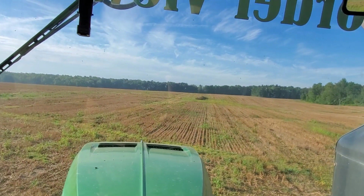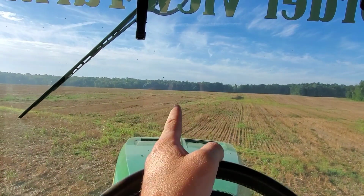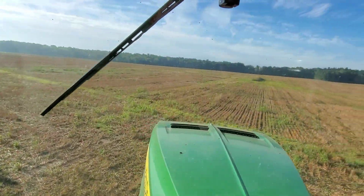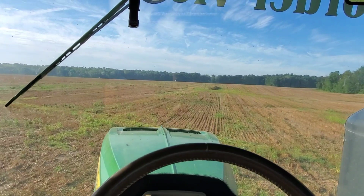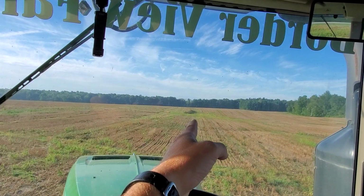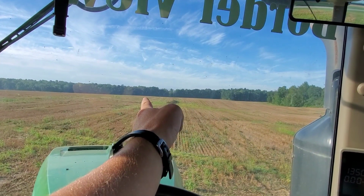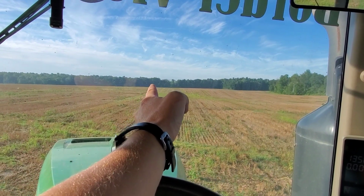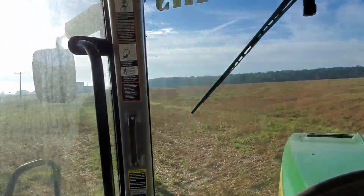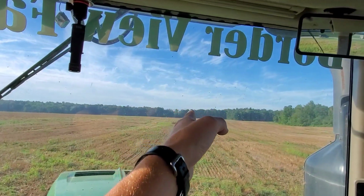And anyway, I've gotten a question a couple of times about going on an angle. We do go on an angle from the rows when we're doing our primary tillage, and so what I like to do is kind of find the angle that I want and then just go basically 5 degrees off of whatever straight north and south is. So in this case, we're heading south. I want to go 5 degrees back to the southeast, and so we're going to key in. Directionally, 0 degrees is straight north, 90 degrees is straight east, 180 degrees is straight south.